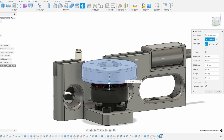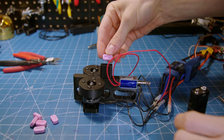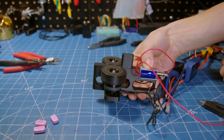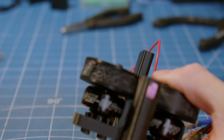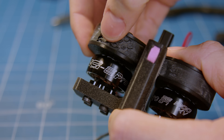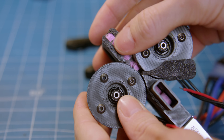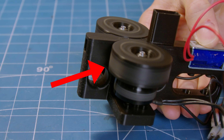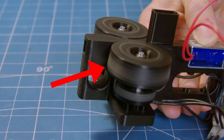So I redesigned the launch wheels to accommodate the taller dimensions, assembled a new test frame, and gave it another go. This time, I was able to get the wheels up to full speed and even launch a couple pieces of candy. However, it was short-lived because the treads then experienced rapid, unscheduled disassembly. Just like the rubber treads from my first test, the extreme speeds were ripping the material apart from the inside. As an added bonus, the shredded TPU also decided to embed itself in the now pulverized candy, which caused some slight clogging of the barrel. Looking back through the footage, you can see the treads slowly expand outwards the faster the wheel spins, which eventually causes them to self-destruct.